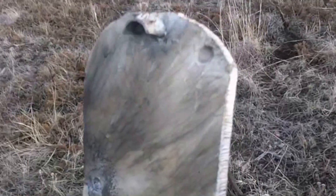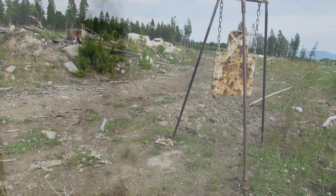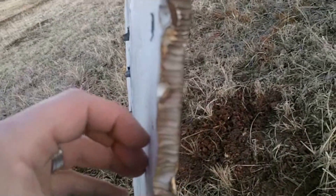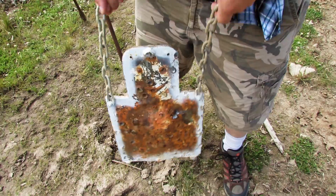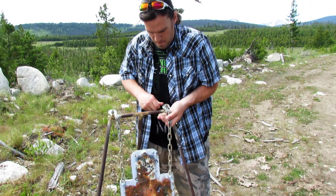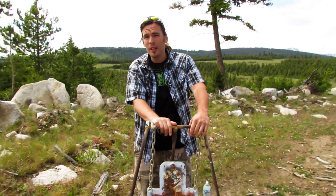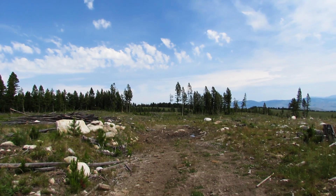For those using milder steel, you're going to see some interesting things in the field. Not only do you get pock marks, divots, cratering, and warping, but if you're using heavy ammo you can have complete or partial penetration — like we saw with the M33 ball ammo through the half-inch plate. Not to mention the tooling required to cut this stuff to a smooth edge is incredibly difficult. Even with a torch, you get real nasty jagged edges. That might not seem like a big deal since you're only shooting at it, but you've got to set this thing up too. Dragging it out of a pickup tears up the bed horribly, and those jagged edges will slice up your hands — entire worlds of trouble that folks don't think about when custom making their own steel targets.